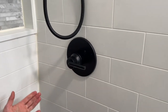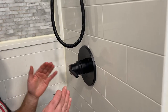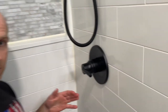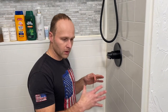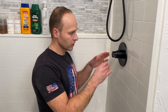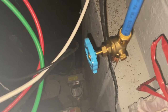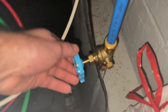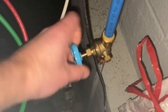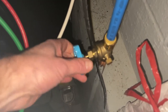If you have that issue where it's reversed, we're going to show you how to fix it. First, you have to turn off the water flow to your house — go to the basement, find your water meter, and turn off that knob. You want to find where your main water valve is, which is going to be next to the meter. I'm going to cut it off right here — that cuts off water to my water heater and to the rest of the house.